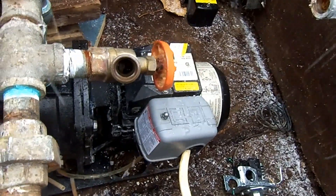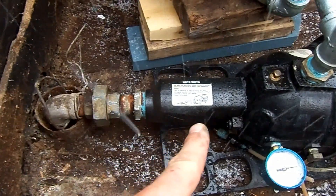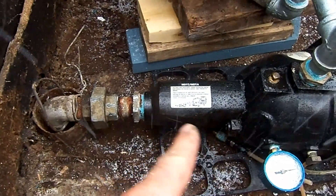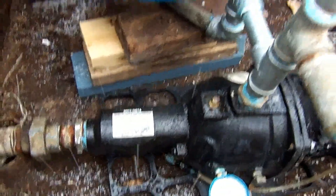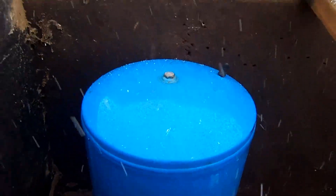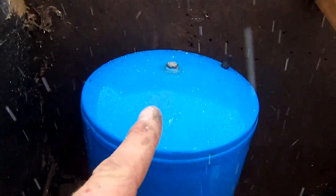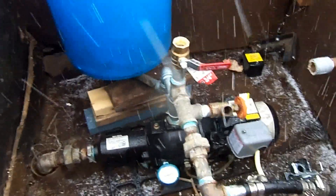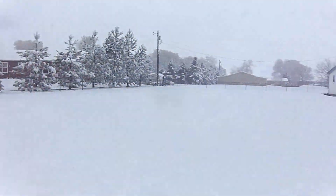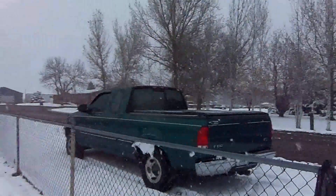The motor winds up, gets hot, and shuts off — so it's obviously no good. Plus I forgot to put the correct nozzle in the injector for a shallow well adjustment, and I put a permanent gasket on it so I have to take it apart anyways. It didn't dawn on me until last night that the water's going into this tank but not coming out, which means the bladder is bad and the tank is bad. I got ahead of myself because I was trying to beat the storm, and all I did was ensure I'd have to be working out here anyways.